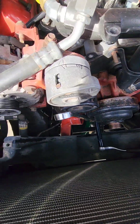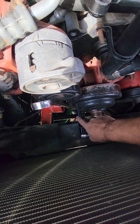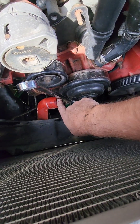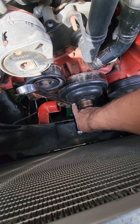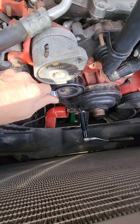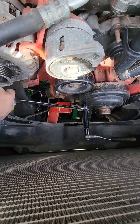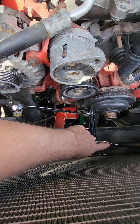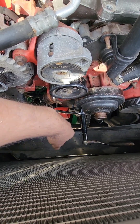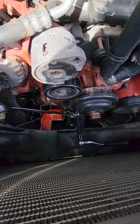The setup is I've got the ratchet on here set up as if I was going to turn it clockwise, but you're not going to turn this — it's just holding it stationary while you turn the wrench on the slider portion of the tool. As it gets tighter, it may start trying to turn the whole thing, which is why you've got to hold the inner portion stationary.